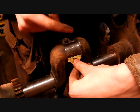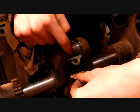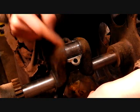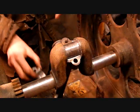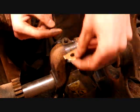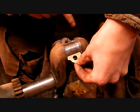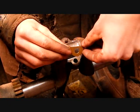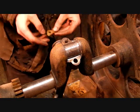That positioning prevents the babbitt from rotating and spinning between the babbitt and either the connecting rod or the cap. You also want to make sure this surface doesn't get too close to the journal on the crankshaft, or it'll start scratching it. That's why I made these out of brass — if they do touch for whatever reason, it's brass and it's not going to hurt anything.